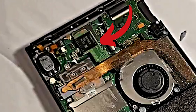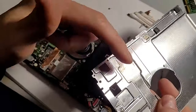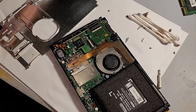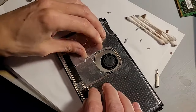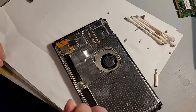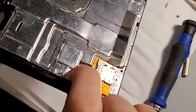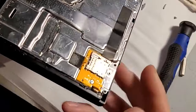Pop the RAM chip and the cover back on the Wi-Fi chip. Make sure everything's pressed down firmly. Start by bending in the tin backing so that it presses more tightly up against the heat sink, then put a gob of thermal paste and press it all down tightly. The tin backing acts as a massive heat sink, which will pull heat away from everywhere else. As you're pressing all this in, make sure your SD card plug holder is connected properly — this one is a bit finicky and will take you a few minutes to get right.